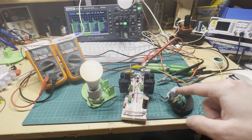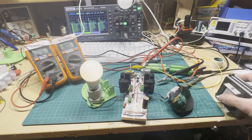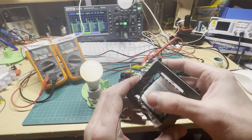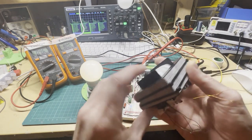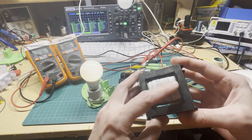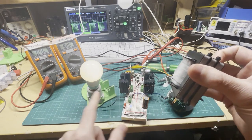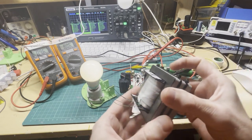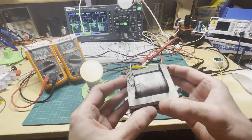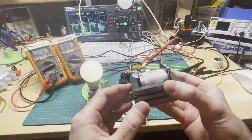circuits. And I've noticed that the efficiency is really coming from this transformer. I initially had built just a conventional transformer with 2 E-cores, and it took me most part of the day to wind this neatly. When I connected this transformer to the circuit, the current draw from this was 500 milliamps. It seems that the current just sinks into the core and there's no efficiency at all.